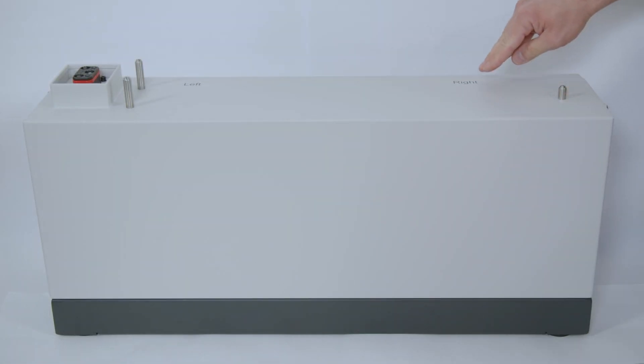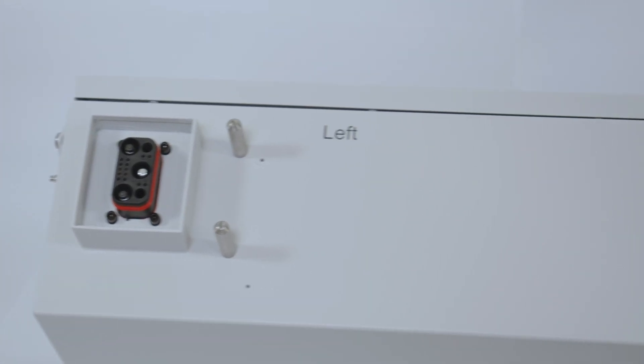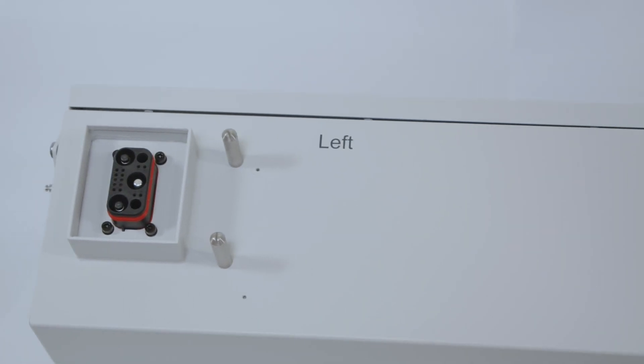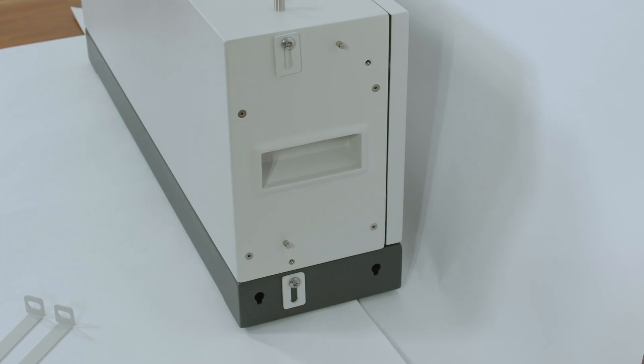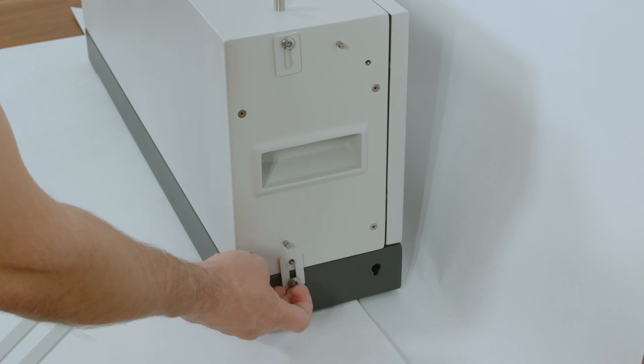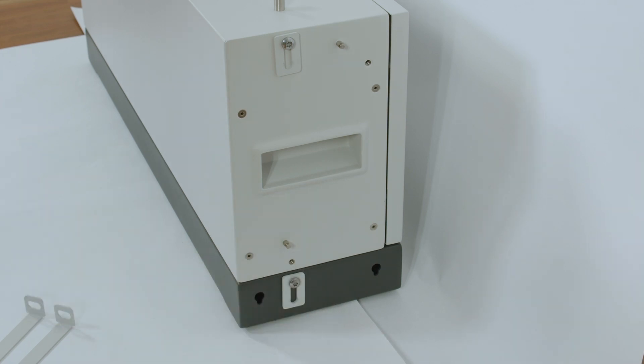Please make sure to always align the left and right side correctly, since on the left side there is the DC plug as well as the mechanical connectors to connect the battery modules to each other. To fix the modules to each other there are mechanical components on the side of the reservoir that are tightened with a Torx 30 at 5 Nm.